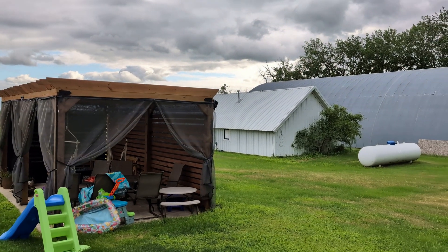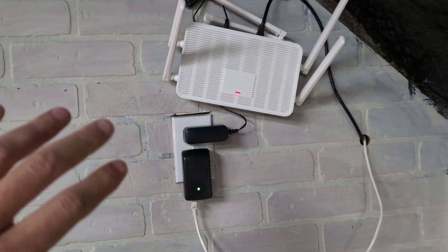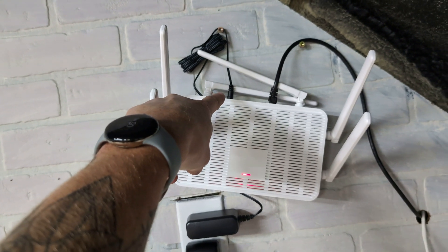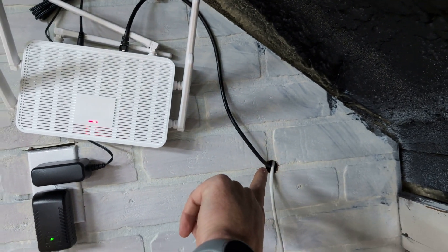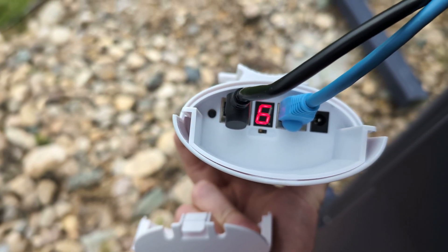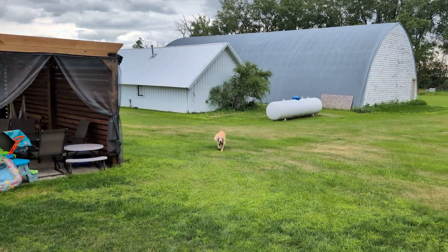Now I'm going to go over to that building — I just recently mounted the bridge over there. I've got the ethernet cable running into my shop and I need a second one for the power on that unit. Inside my wood shop, I bought a separate router. I have an ethernet cable running from this router to the bridge on the outside of the wood shop, and a second ethernet cable coming from the bridge into its own power supply in the PoE port. Using that little black button, push it until you get to the channel you want — I put mine on channel six. I'm now going to put the cap on and then set the other bridge to channel six as well.